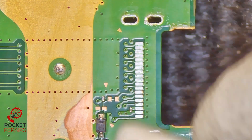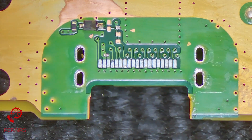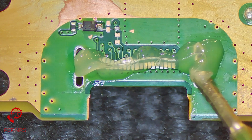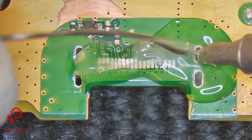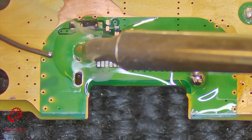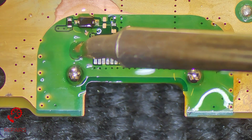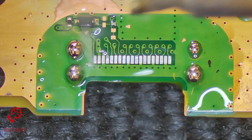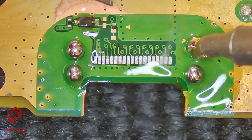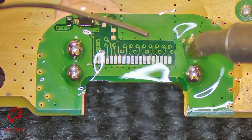Now that we've got everything clear, we literally just fill everything up with a bunch of leaded solder, come in with our flux - plenty of flux - and I just like to leave big blobs on top. The reason why I'm leaving these big blobs on top is because when I heat the board, I like to use a heat-and-drop method. These blobs will flow through and wrap themselves around the port itself.